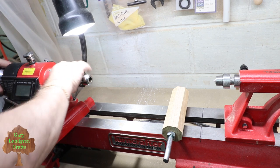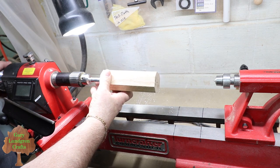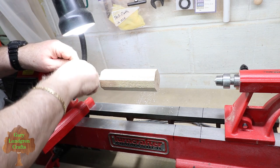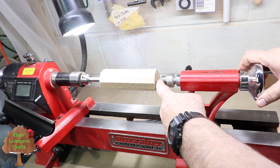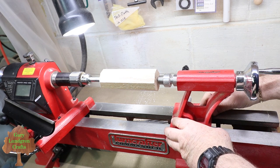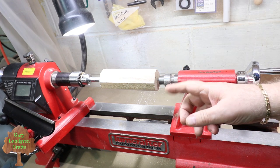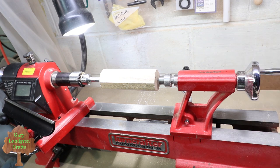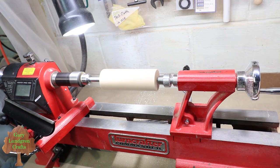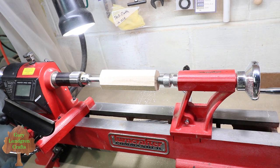I use little plastic washers to help prevent the chuck from getting locked up too tight. Next I put the spindle on and tighten up the chuck, then slide up the tailstock to match the dimple of my center mark—getting very close but not quite touching—and tighten down the tailstock. Then I start the lathe up and advance the quill on the tailstock into the end so it pretty well centers itself. After that I set up my banjo and start getting this to a cylindrical round.